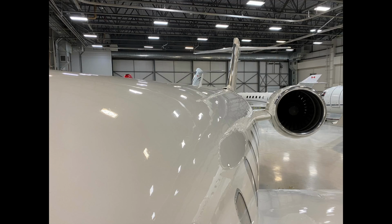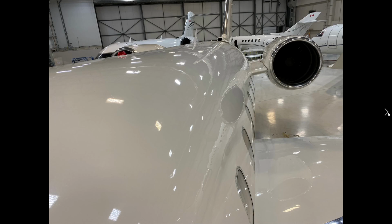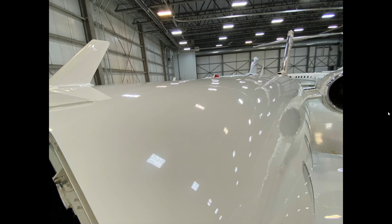Standing on top now, looking back. Fuselage, looking for any signs of ice on the top if we're outside, any deformities, that kind of thing. Maybe a bird hit it, who knows. Look at same thing all the way around, ram air in the back. All these different ports are all free and clear. Ram air. Looking good.